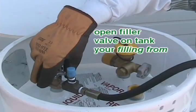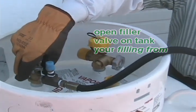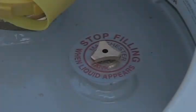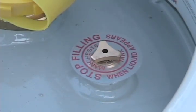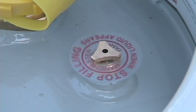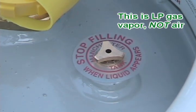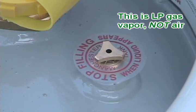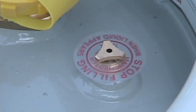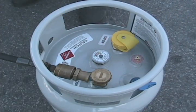Open the valve on your filler tank to begin fueling. You'll notice right away a hissing sound coming from the 20% gauge — that's the excess propane vapor allowed to escape during the filling process. Continue filling until liquid appears in spurts from the 20% gauge.